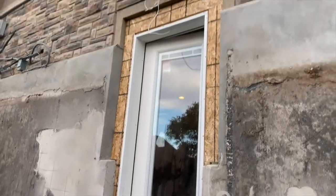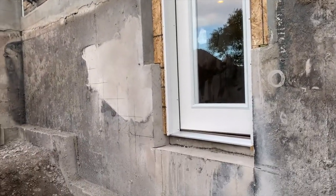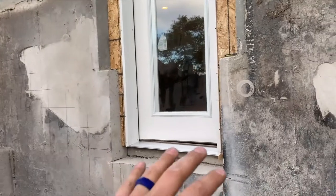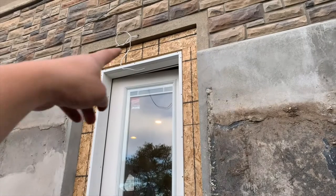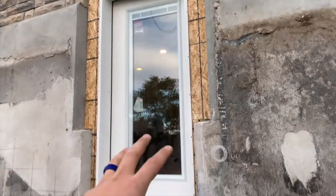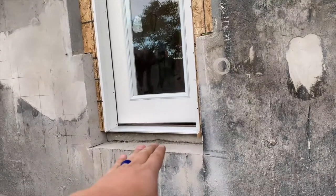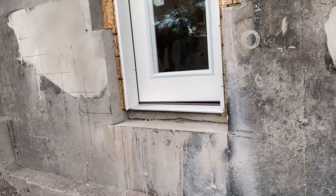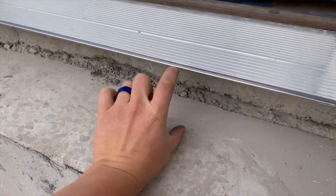Here we are. We've got the house and this is the foundation, the basement. We've done quite a bit of excavation — we've got a mountain of dirt. Here's the walkout. We cut this — it used to be a window here, and then we turned it into a door. We cut the bottom part of the window out and left it four inches lower, so when we pour our walkout landing we'll have fresh new concrete going underneath that threshold.